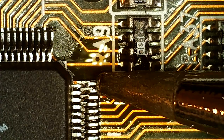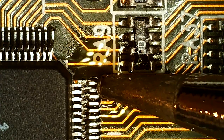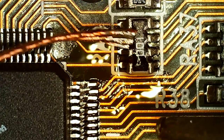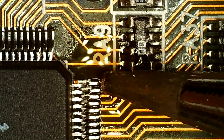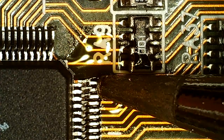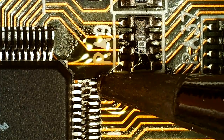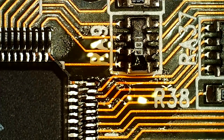So I think the FBI on the Voodoo2 I got is dead, because I've been poking around that card for a day, just checking everything, like this resistor array, everything like that checked out. There's no shorts, nothing missing, so on, everything checks out. So far I can't find anything visual or measurable outside, like new simple caps and resistors and stuff, so I'm a bit unsure what to do, because I have no spare FBI for that card.